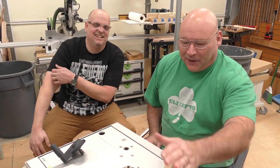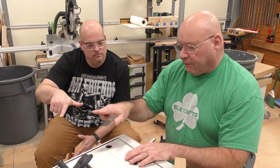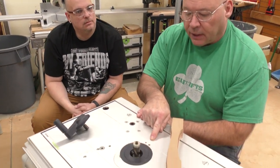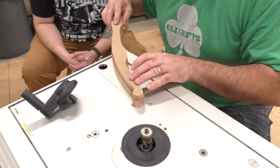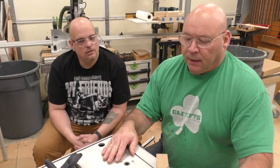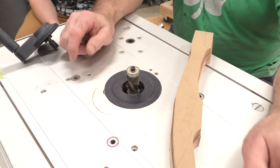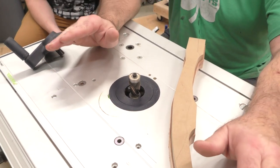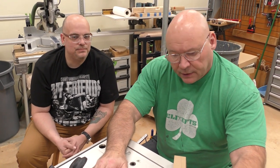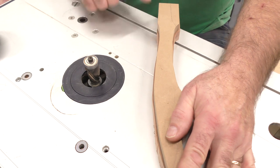Have you ever used the router table before? No. We're learning a lot in this build series. This is a different animal. Remember I told you with the handheld router we had the template on top and followed it left to right? This is different — the rotation. You can see the arrow right here; the rotation's this way. So we are going to go right to left, following like this. Now see this bearing right here — this bit is a compression, but it's an up-and-down spiral. This is a really good template bit. I'm not too concerned today with grain direction because of the up-down spiral. There's a lot to this — we have to adjust this bearing so it rides the template that is absolutely to our standards.